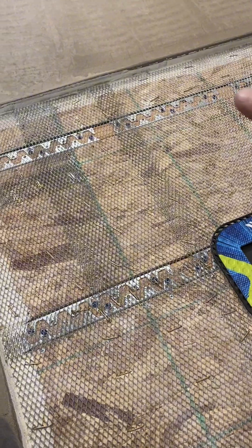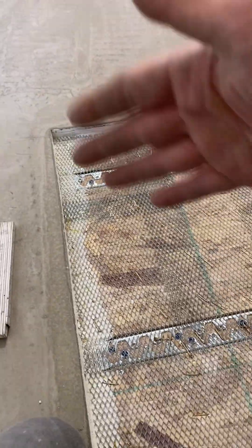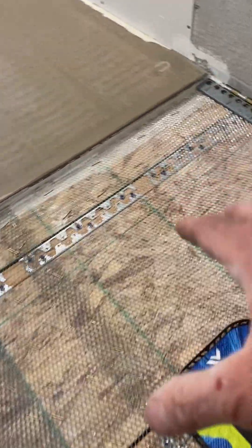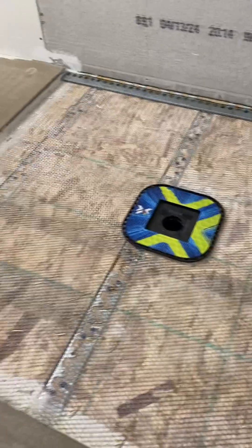I want a solid quarter inch per foot. I've got three-quarter inch slope basically from drain to there now, which is a little under three feet, so I'm good with that. So, 330 fast pan — this is something I've been doing. MAPEI doesn't necessarily sanction it; they have not told me I can't do it. But this is do-at-your-own-risk kind of thing. I've done a bunch of them, I'm comfortable with it, I'm confident in it.